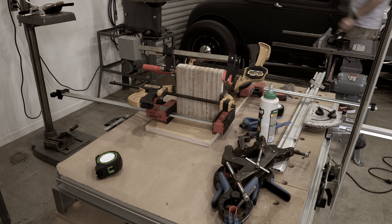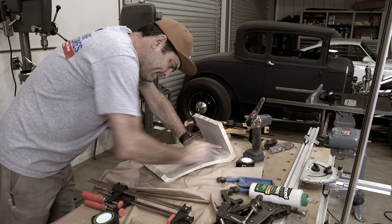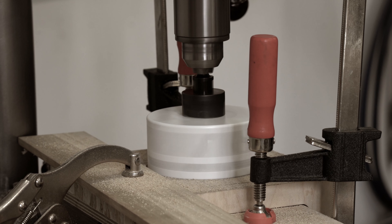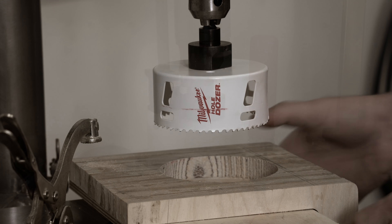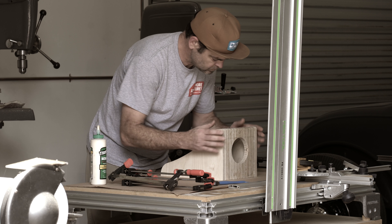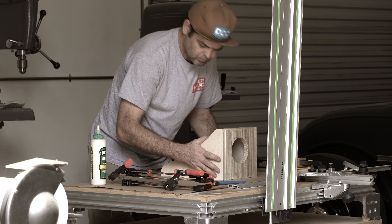My alignment turned out close enough that I could fix any imperfections with a little sanding, so before I glued the sides to the dust chute, I decided to clean up the inside as best I could. Next on my to-do list was the dust port. I've never had much luck with hole saws larger than a couple of inches, so I was pretty nervous about boring this four-inch hole in a part I had so much time in — but to my surprise it went pretty well, and my old Craftsman drill press made short work of the chore. Now I was ready to glue on the sides of the chute, which was pretty straightforward, and once done I had the sexy shape I was after, but also a bit of a hurdle to jump.